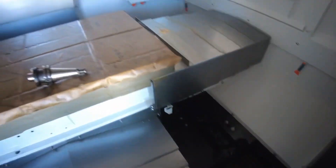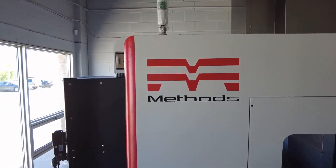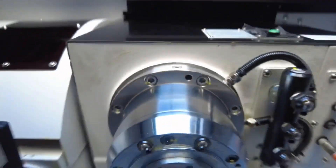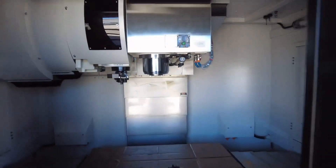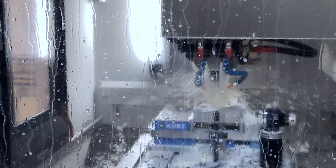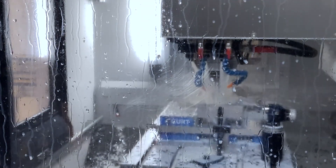When I'm looking in this machine, I see some fifth-axis work holding. I'm sure you could utilize something else, but what I want to focus on is the quick change ability and the possible addition of, say, a plus two, some sort of trunnion. All of this goes into a job shop environment as well, right? Absolutely. We can add a fourth-axis to this. We can't do true five-axis on this machine — we can do three plus two, we can do four plus one. We can use a lot of different vendors for rotary tables. Put multiple parts on a pallet, or just some four plus one type work and knock out multiple sides.